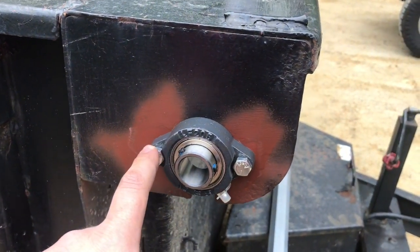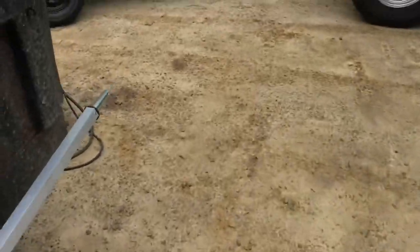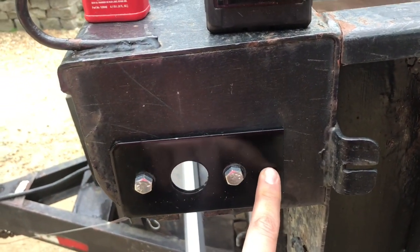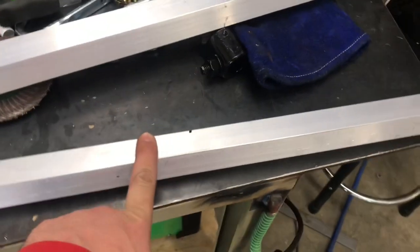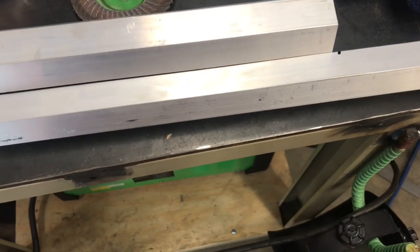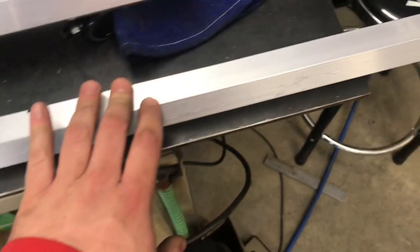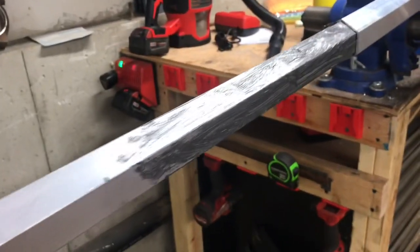This side's all mounted up. What I did is there were two holes on this side — I welded them both up and then re-drilled the hole so it lined up, shot it with a quick coat of primer. On the other side I already got the two holes drilled out and I cut the bracket it came with short so it would clear the other bracket, and I'm using that as a template to drill the hole for the latch mechanism. The shaft that goes from side to side has this inner piece which allows the adjustability. I marked the center point, slide it in until it matches, put a couple screws in to hold it in place, expand it to the right size, and screw down the other side — with a good healthy load of anti-seize.